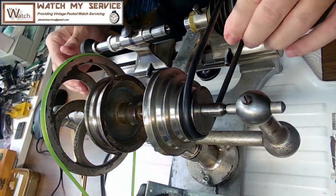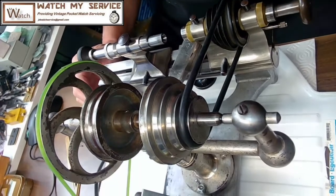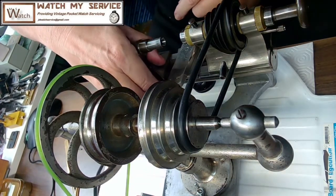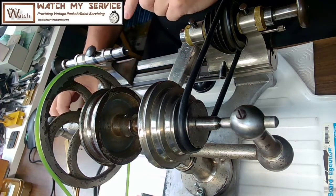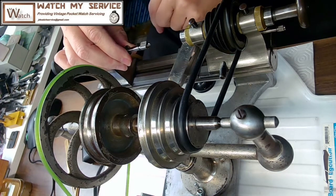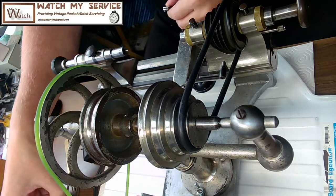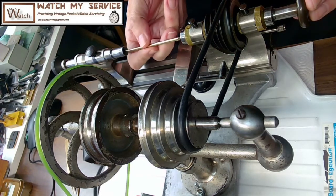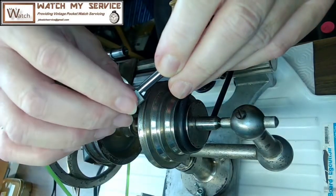Make sure everything is loose before you start the lathe up, otherwise you'll have problems. I've got my tip-over tool rest and tailstock in place. My tailstock is a micrometer tailstock — very nice — and it holds a collet. My challenge is getting this lathe dog set up so it's centered and will run through the material. I'll pick a piece of material to work on and I'll use this rod I have available — I need to measure it, get the right collet, and face it off.